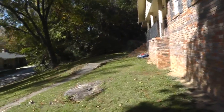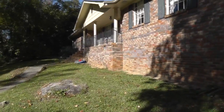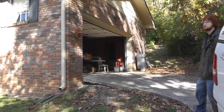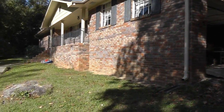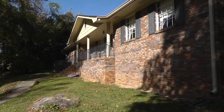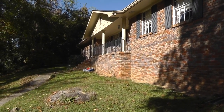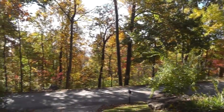The problem was moisture. Water was coming off the hill in the back and running under the floor. There was not a very good drain system and not a very good ventilation system on the foundation either. So all the wood under there just soaked up that moisture over the years and dry-rotted. But it does have a pretty view.